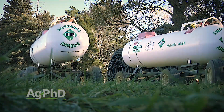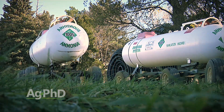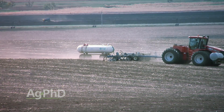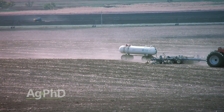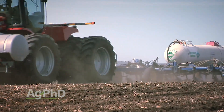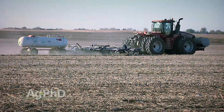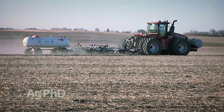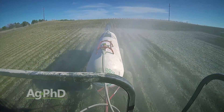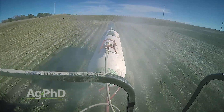Begin by inspecting the equipment before each use. Look for cracks on hoses or signs of wear or slippage around couplers. While most experienced operators aren't scared of a little product in the lines, you are taking a risk if you don't purge the lines each time you unhook or inspect them. Check the toolbar quick coupler regularly and replace as recommended or as wear dictates. When switching from tank to tank, make sure your hoses are the proper length. Always use the safety chains and hitch pin with safety clip to ensure that the hoses aren't stretched and that a tank never comes unhooked.